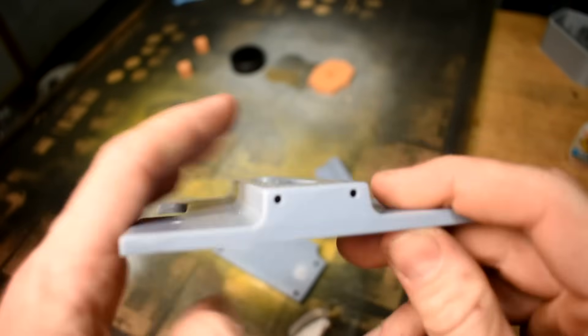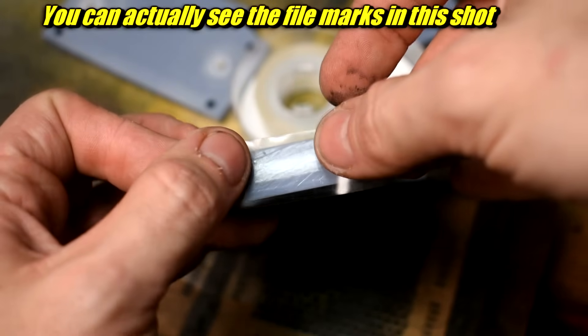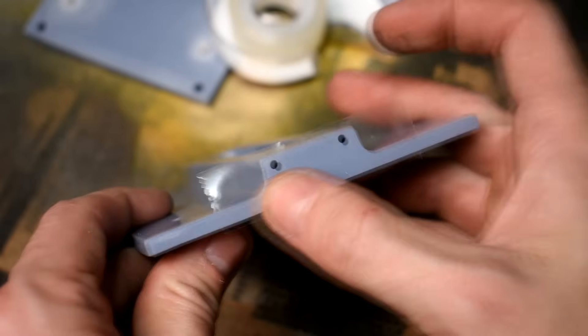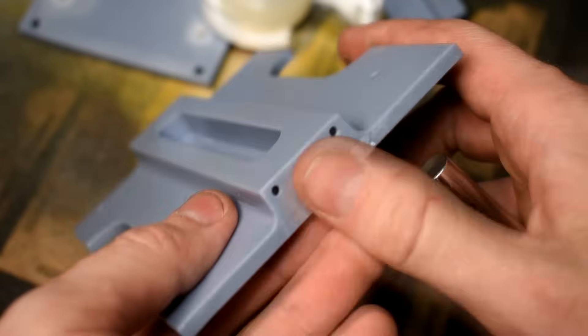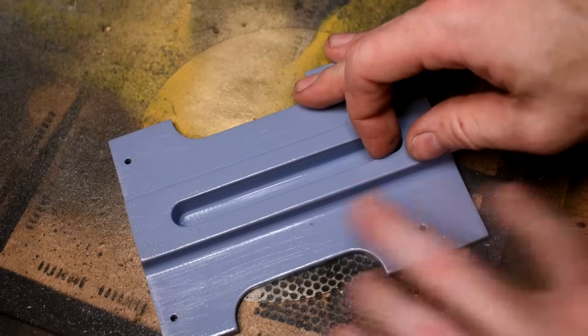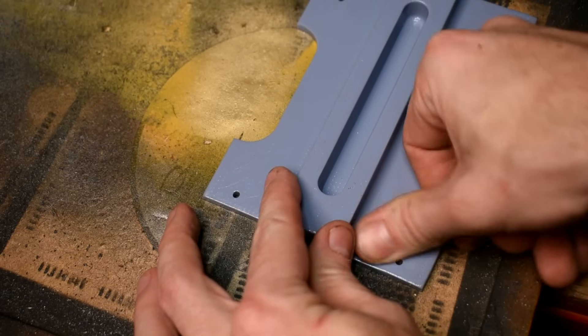A little extra care making the pattern will make the final result more successful. You can't cast something that looks better than your pattern — worse, yes; better, no. Speaking of issues with the pattern, I do have a couple of drain holes here that are going to be a problem. Now you may think this looks like just normal scotch tape. This is special gift wrap kind because it's the Christmas season right now and I don't have the normal kind. The only goal here is to stop the sand from getting in those holes and causing a little unsightly divot.